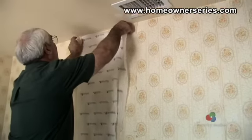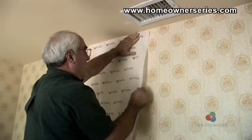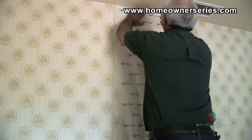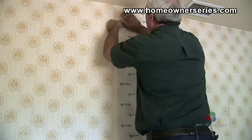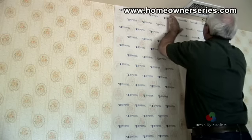Next, take out the cloth sheeting from the bucket that has been pre-soaking in a mixture of water and wallpaper stripping chemical for a short time. Place the sheeting on the wall, beginning with the edge of the wall and ceiling. Smooth out the sheeting with your hand so that no area is left without contact to the sheeting. Now cover the entire surface area of the wall where the paper is to be removed.